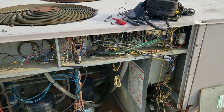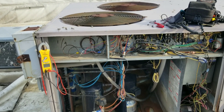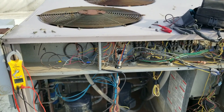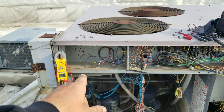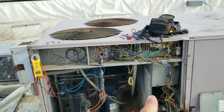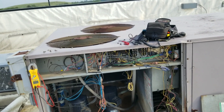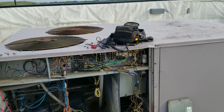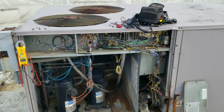With low voltage shorts, you've got to be really aware of little stuff like that, because it just takes the tiniest rub-out on the tiniest wire in the most obscure place to create this sort of problem. I'm going to cut and splice that wire, then recommission the system. I'll adjust the thermostat and verify everything functions fine first, then replace that fuse — I don't want to leave a pile of burned-out 5-amp fuses up here.